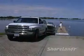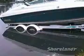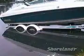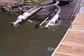And as you're backing into the water, a good rule of thumb is to back the trailer in until the taillight step pad is at or slightly below water level. On extremely flat ramps, you will usually need to back in farther, but on steeper ramps, not so far. Also, any bunk trailer may require that you back in farther than the rear step, even in good ramp conditions. The goal is to get the trailer in far enough so that the boat is beginning to float.